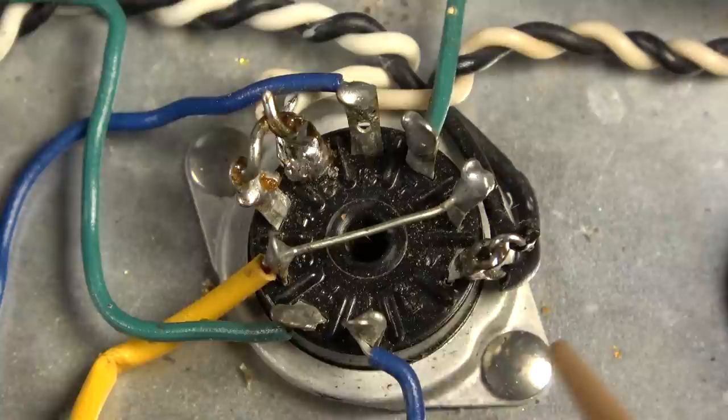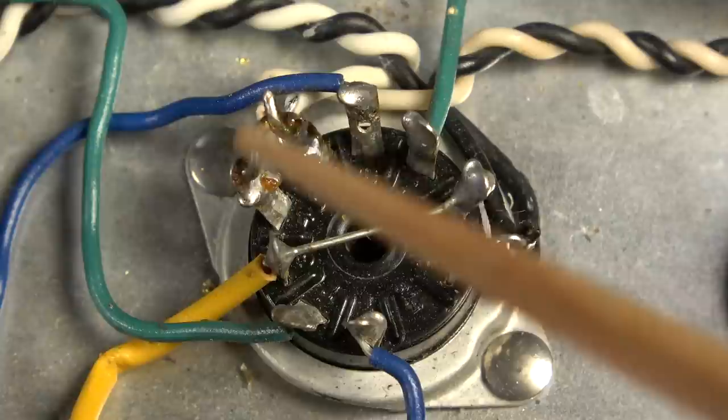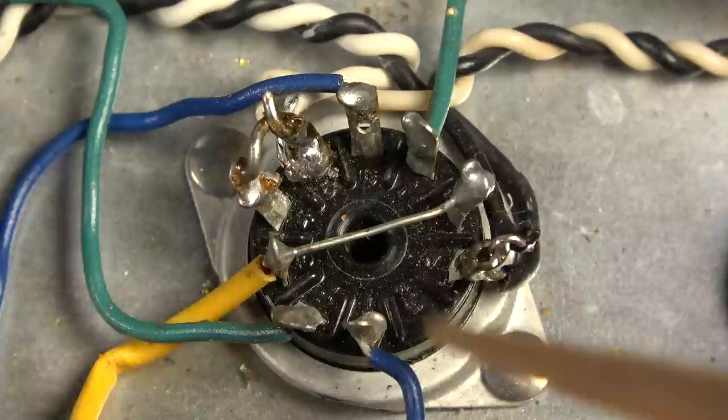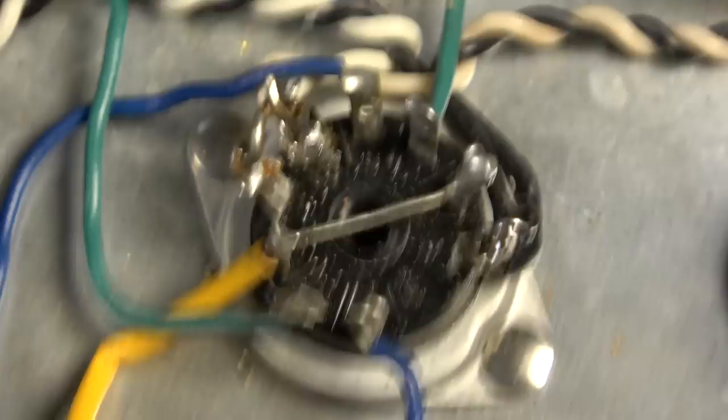However, in the actual amp we see right here, here's pin 9, and it has black wires that are part of the filament circuit, and then we've got these tied up over here just like a 6 volt 12AX7 would be, or 12AU7 or whatever. But he provided me with a 6FQ7 in the box, and that's what's in here now. I'm going to replace that FQ7 with a 12AX7 or AU7 or whatever, and see if it comes to life. I have a suspicion it's probably going to.